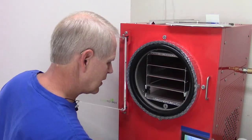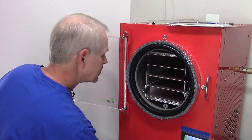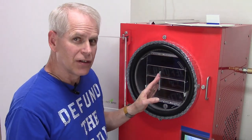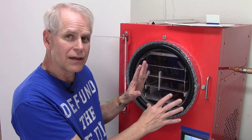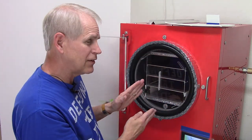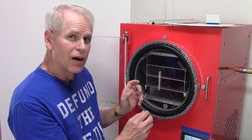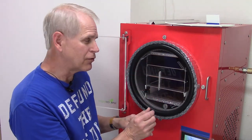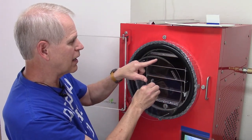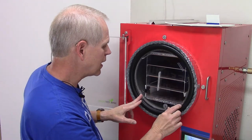I'm going to make sure that the seal is nice and clean and get the plastic shield in place. The plastic shield I use is just a piece of clear acrylic that I cut to fit this opening — specifically this opening facing this direction. The barrel on ours is not exactly round; it's off by three or four millimeters, maybe an eighth of an inch out of round. So if I try to put this in a different orientation, it won't fit. We have a little arrow at the top pointing to the top middle spot, and when we put it in that way, it's a great fit.